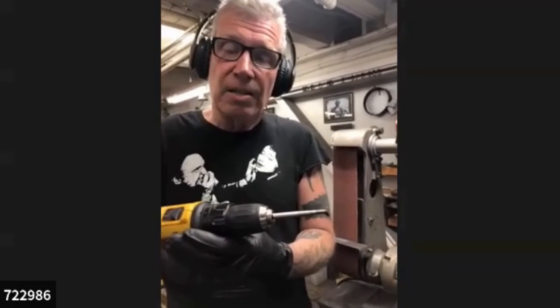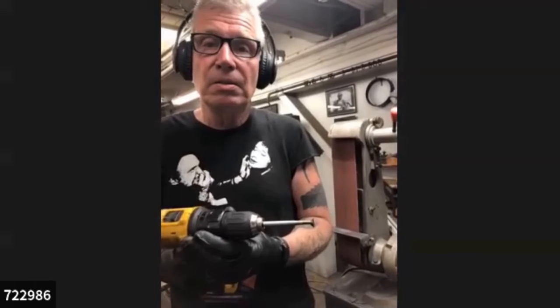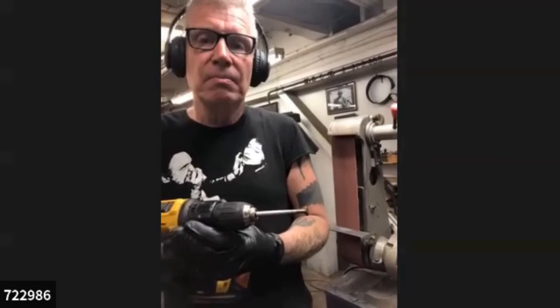Someone has asked, why are you putting that taper behind the working end of the chisel? I'm so happy you asked, because I was working out my explanation for that while I was doing it. There's a reason why, and many of my tools have that. If you have the straight 5/16 right down to the end, sure, it's a lot stronger and will remain stronger forever that way, but I can see around it. When I'm working on the repoussé, it's less of a huge thing in my face and blocking my way. So I can visually see around it. Yeah, all right, excellent. Thank you.